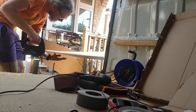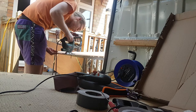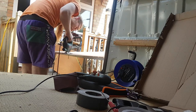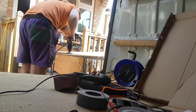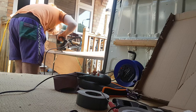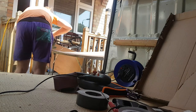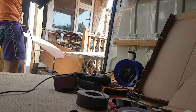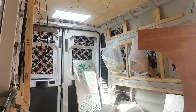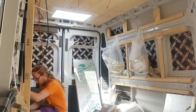I managed to mount the plywood on a table and my workbench to cut it out. In hindsight I should have given myself more leeway and cut more off, because a little bit extra was a lot worse than a little bit less — unlike thicker plywood, this 3mm stuff really didn't like being shaved and had a tendency to split. So cutting it down further risked ruining the whole thing. I did have to cut a little more after the initial test, and then decided I was happy with it, though really it probably wasn't small enough.